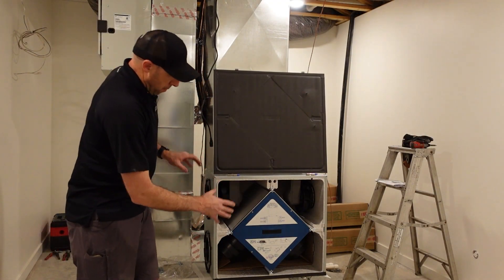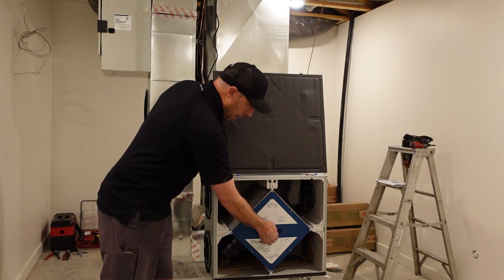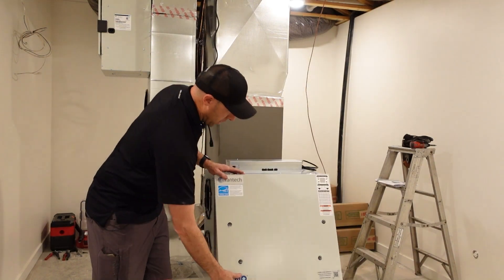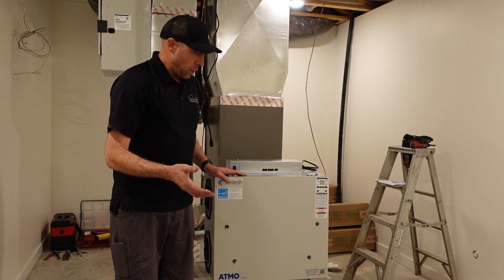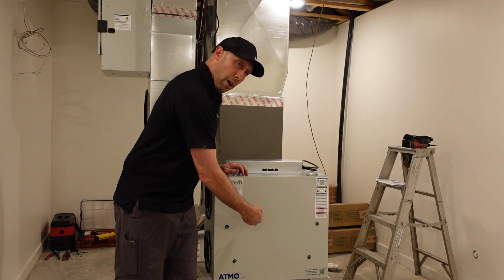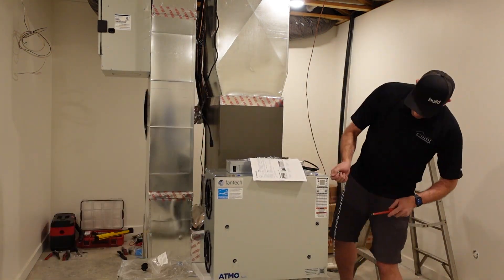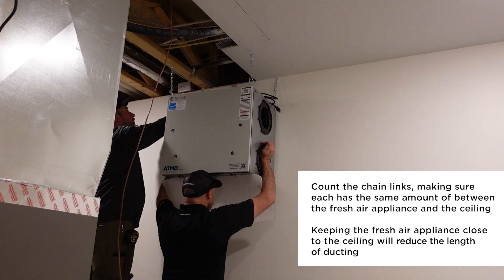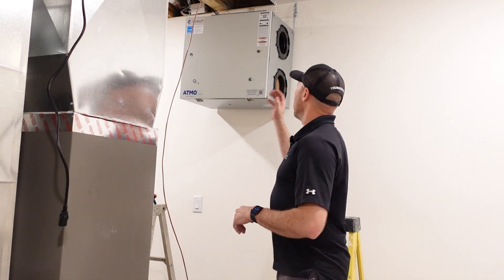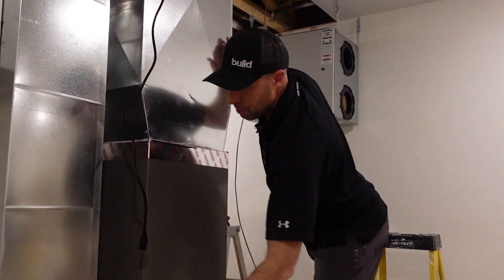It's essentially fans and the core — a magic box that does all the important things, and it's all well sealed. There are some balancing ports here so once we get the unit in place we can commission it to make sure that we're drawing in and discharging at a balanced rate. The very first thing we want to do is bend out these tabs. We're going to use the springs provided so that we can dampen any bounce. We'll be using six inch flex, coming off the two ports to withdraw from the return and then enter the return with the fresh air.